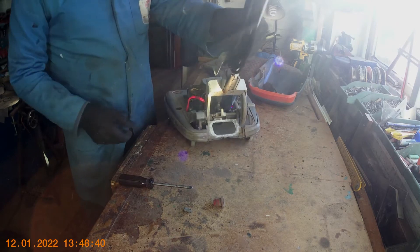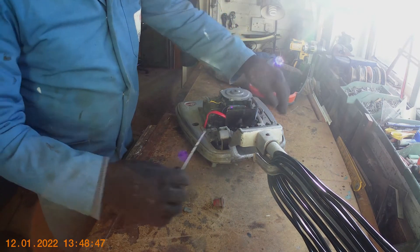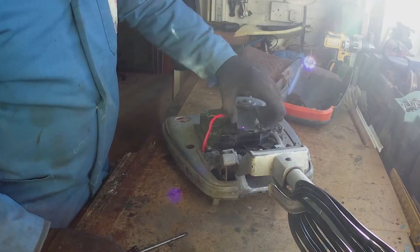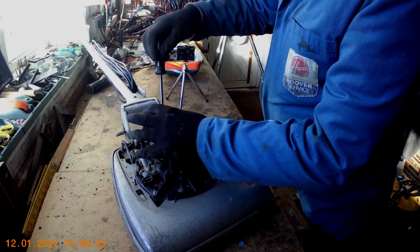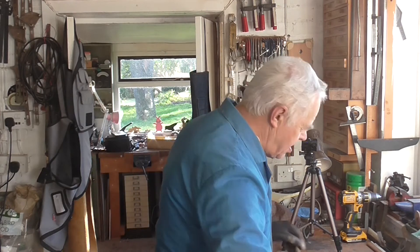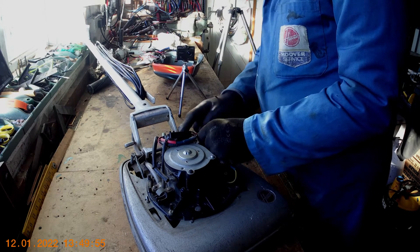You've got to disconnect the wires in here but there's a little cover on there and it's a bit fiddly because it's down there. So it's always easier to take the terminal block off — there's just one screw there. Just undo that little self-tapping screw, take that off and put it in the lid. You can lift this up now to get a better look. There's just one screw to hold the cover on, just undo that. Always pop your screws and things in the hood so you won't lose them. Then there are basically two screws here to undo for the switch wires.